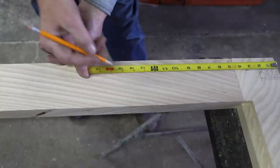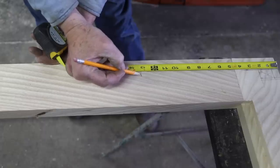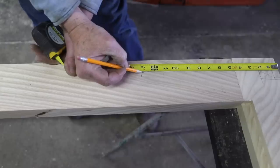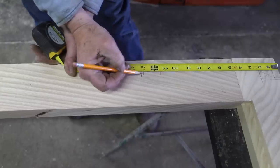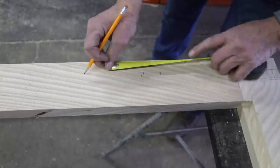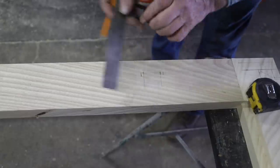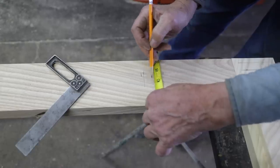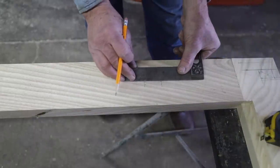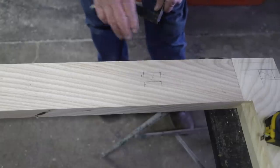And then for my second frame, you say 14 is going to be my sideboard. I want to inset it 3/4 inch for my back panel. And then that framework is 2 inches. So this one, I think I may come in and do my 1½, but I'm going to offset that 1/4 inch on both sides. Come in my 1¼. I'm going to mortise this at 7/8. Will give me my 1/4 inch shoulder. So that's where I'm going to mortise the inside corner of this driver's box. Again, I'll do this both sides.